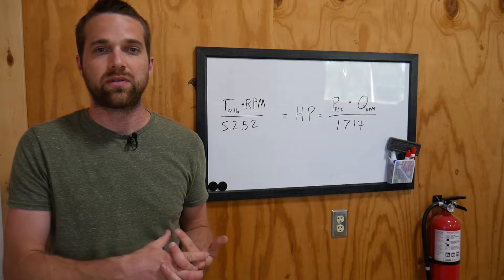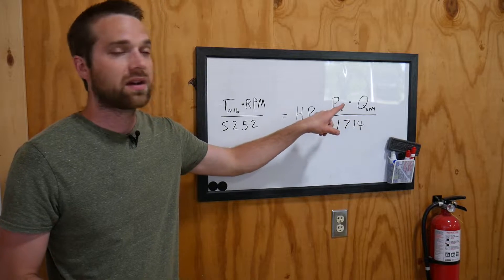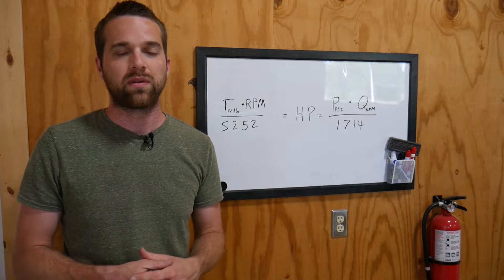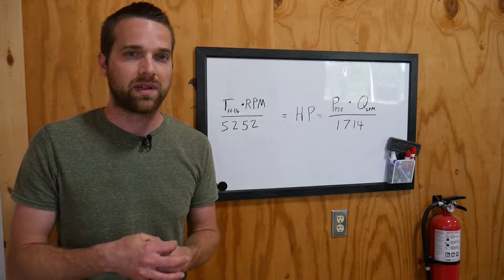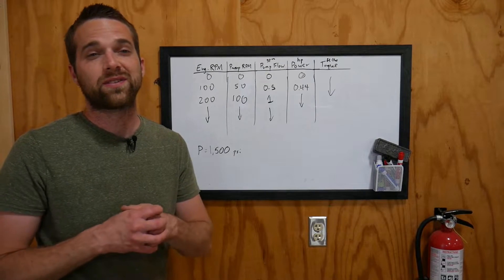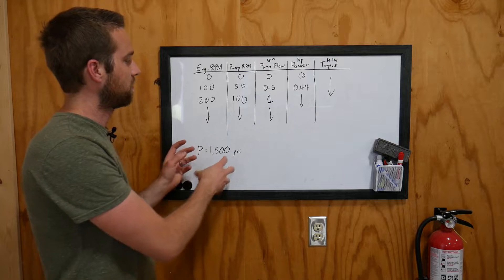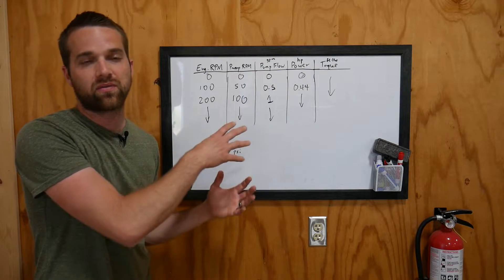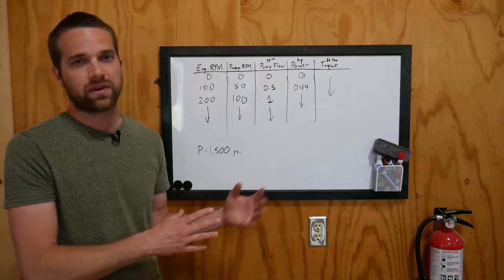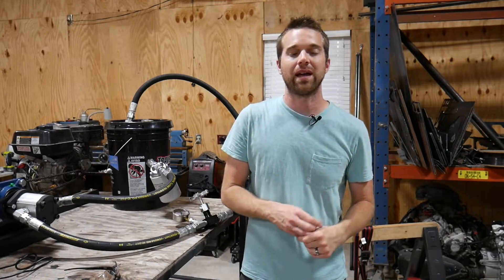On the left side — traditional mechanical horsepower: torque in foot-pounds from the moment arm, and RPM from the rotary encoder. Both sides are equivalent to horsepower. I could measure horsepower from the hydraulic side using a pressure sensor and flow meter, but a flow meter is more expensive. Going the torque-measurement route is a more cost-effective approach for a budget dyno. One of the simplest ways to work through the math is to make a table in Excel, manipulate the variables, and back out a torque value to verify your load cell is working in the right range.